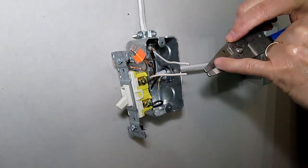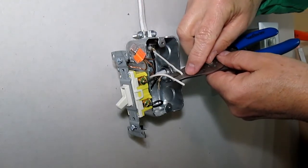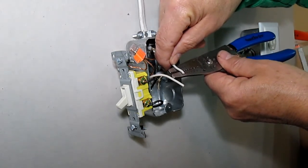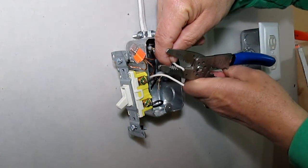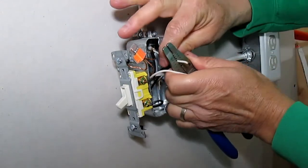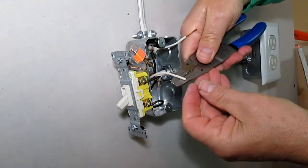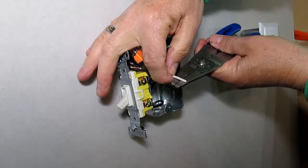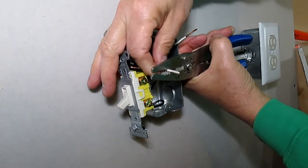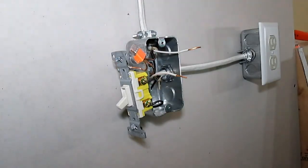How far up do you strip? There's a little gauge on the tool — you put your wire across it, put your thumbnail right at the edge, and that's how far you need to take off. So I go to 14, clamp down, give it a twist, and it comes right off. Now the other one: put my thumb right there, put it on 14, give it a little twist, and there we go — they're nice and straight.